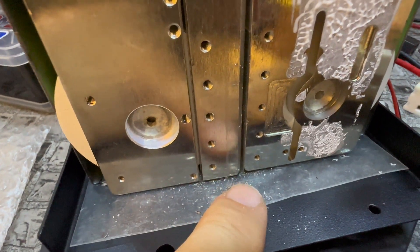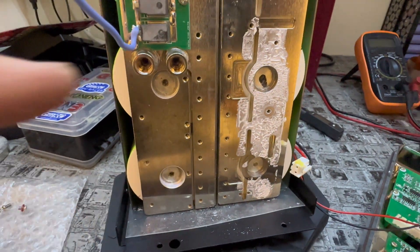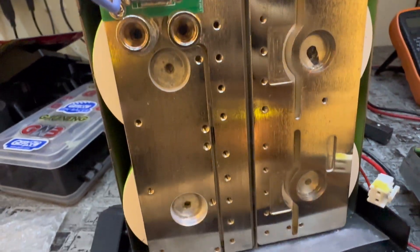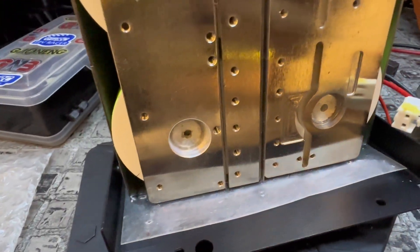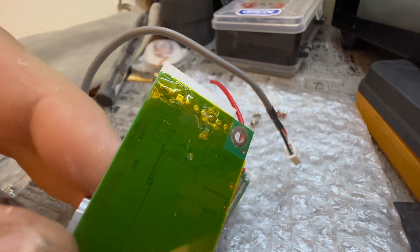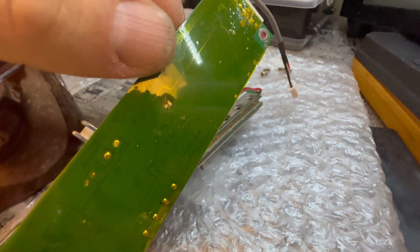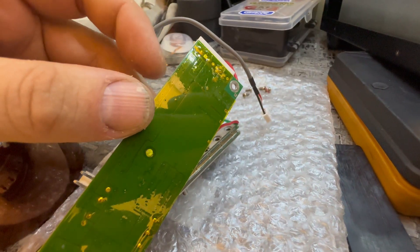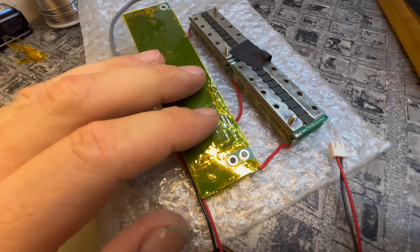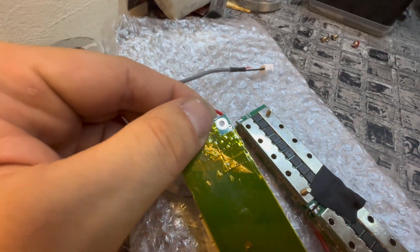There seems to be a lot of shards of metal. I'm going to try and remove those before replacing the board because that could have been causing shorting as well. I've cleaned that all up — a lot better than what it was. Looking at the new board, I think I'll put a bit more Kapton tape on there to save it arcing out on the board. That's the back of the board now — it's got another layer of Kapton tape on it. It didn't like just the first layer so it's got a second layer on there.